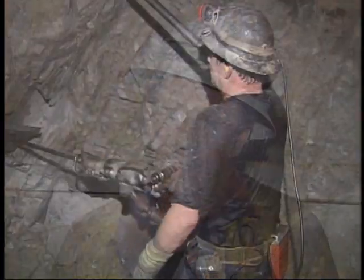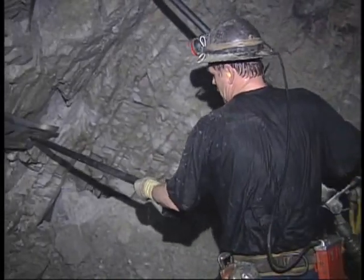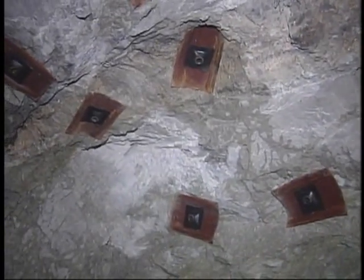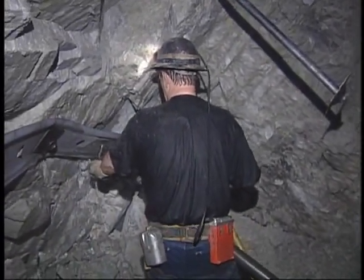If you're in ground that's blowing up a lot, air blast, and you can hear it, that's when you turn your jack leg on so you don't listen to it. No, but you can tell, and it depends on the ground you're in. If you're in real air blast ground, you'll pick it, and the rock will clink just like a piece of china. It's real brittle. And if you get into that kind of ground and she starts talking to you, starts working, you'll actually see the ground move. Then you know you're in bad ground, because if it blows on you, it's going to cut you. If you're in ground that's not working, that's good ground. You tell by your bolts. 90% of the time, if your bolts aren't being mushroomed, or your timber's not being really squeezed, you don't have to worry about that ground. And it is quiet. It'll be just pure quiet. And that's perfect ground condition.